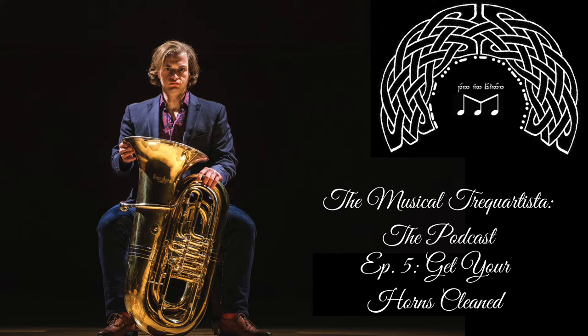The more accurate term for red rot is de-zincification. Breaking that down: 'de' means taking away, 'zinc' is the metal, and '-ification' is the act of it happening. So in de-zincification, the zinc is being taken away from the brass alloy. Brass is made from zinc and copper.